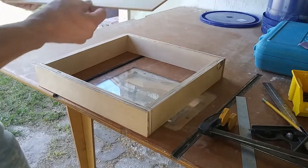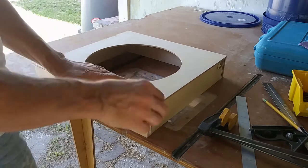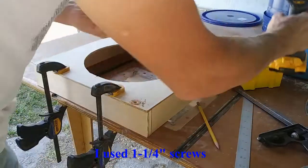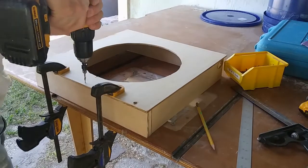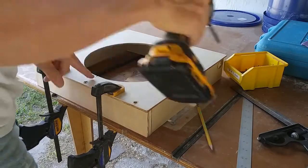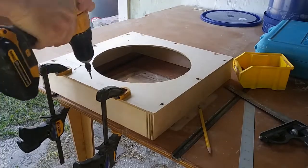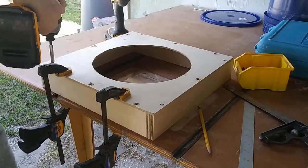After setting the sides loosely together, I placed the 1/2 inch plywood on top, and here you can see that I'd cut it down to 15 inches square. I clamped it in place, then screwed down one long side with some 1/4 inch screws. I marked a line on each side 3/8 inch in from the edge, and pre-drilled the hole for the countersink bit, just to make sure I kept the screws in the center of the plywood sides. I flipped it around and screwed down the other 15 inch side, then fastened the shorter sides as well, making sure that the sides were flush to the top. I chose not to glue this together, as it won't see much stress, and I wasn't really sure that this plan was going to work either.